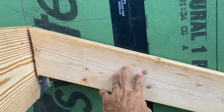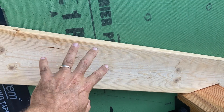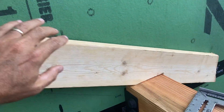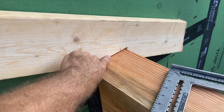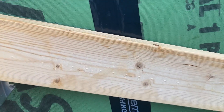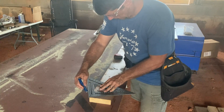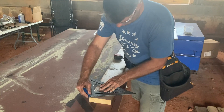It took me two boards to get this set. Now that I have my pattern, so to speak, I can use this board to cut the rest of my rafters. Because we took the time and made everything square, it should work out. I'll show you how I'm cutting these rafters now. The first thing I'm going to do is cut a four and three quarter pitch, which is about a 22-degree pitch, so I'm going to go ahead and mark that.